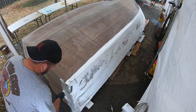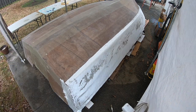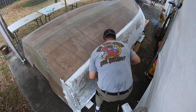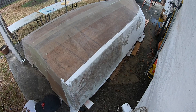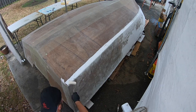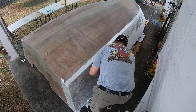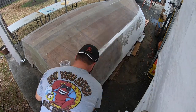I've got that thickened epoxy laying right there on that corner edge of the transom, and you can see it almost pushing through that glass. If you have sharp corners and you put a little thickened epoxy on there - not super thick - and let the glass push into it, it'll actually get into the glass and help hold it down. Rolling that epoxy on just takes a lot - you've just got to put a lot of it on there, let it soak in, then start moving it and spreading it out.